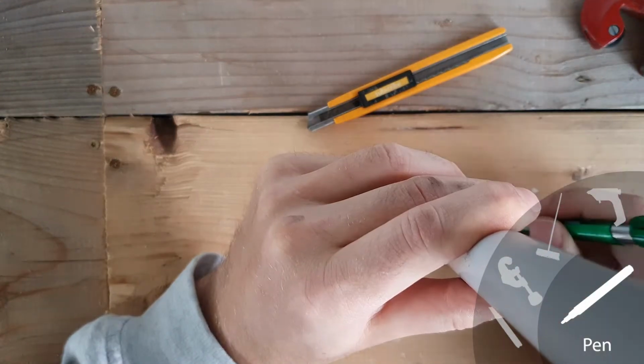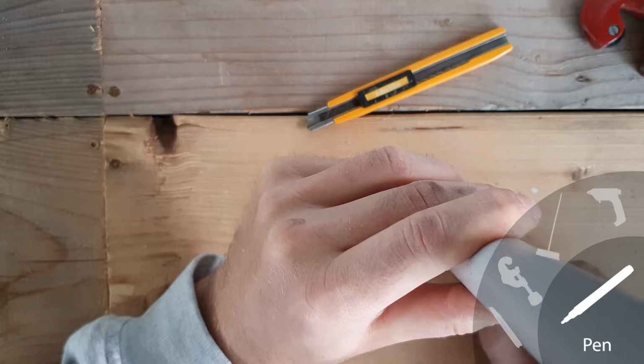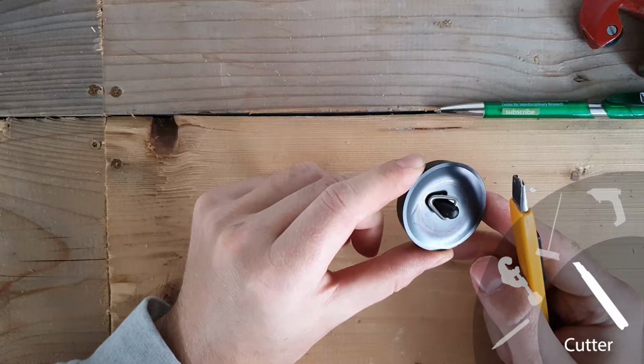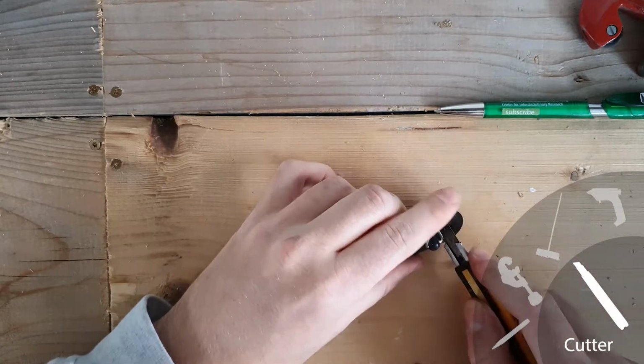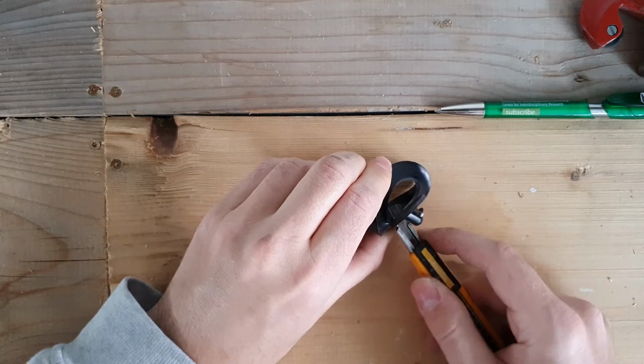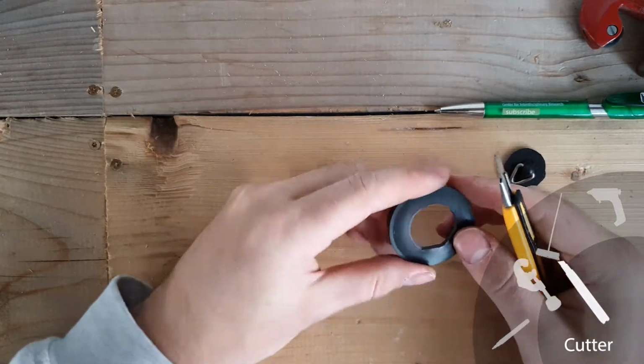There's also a plug which came with the shower drain set, which fits exactly onto the drain. I will cut a hole into this plug to reduce the diameter size and use it as base for the vertical pipe of the bell siphon. The length of the vertical standing pipe sets the height of the water level in the inside of the basin.